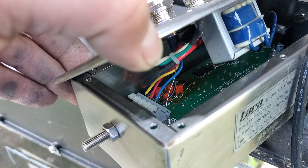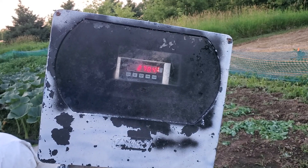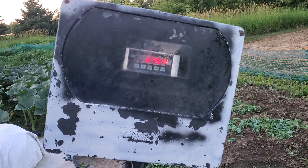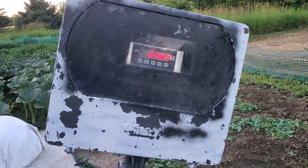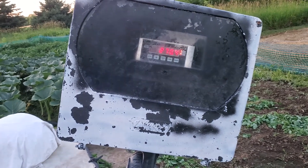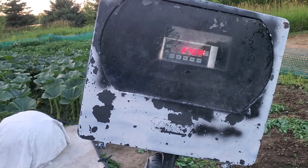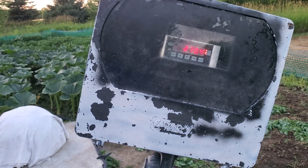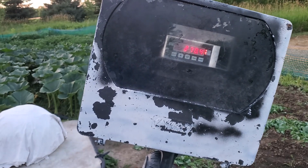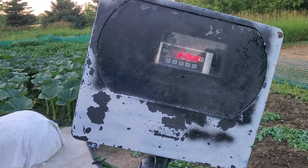So it wasn't making full contact. We got a new wire and we're going to route that up and get it on the scale head — hopefully that'll fix our scale problems and we can still use the scale for the year. If not, we got a real expensive platform for our scale — let's cross our fingers. All right, we got her fixed. I step on the scale, it moves up by my weight. We know the scale reads a hundred pounds without the pumpkin on it, so we've got to subtract a hundred. It'd be 170 right now. If I move the cord all over the place, it moves by like half pound to maybe two pounds — whereas before, if I hit it in the right spot, it'd move by 80. So now we should have pretty accurate scale readings.